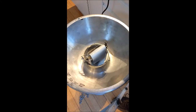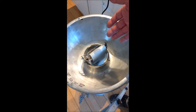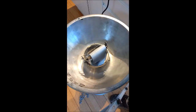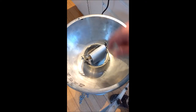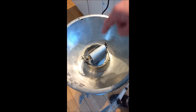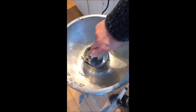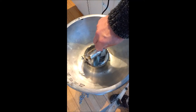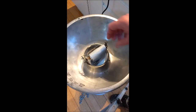Here we have the top end of the machine. You can see the belt, the pulley arrangement, the combs. The comb is just a piece of wire soldered with nails pushed through it — it is that crude. Some of them are knife edges, some of them are just little spikes. It should be arranged so that it's on the downward side, so as the belt is leaving the pulley, you're picking up. This one will charge without actually a comb at all. Under the right conditions, you'll see a spark jump from the pulley down to there. The bottom pulley is just perspex running on phosphor bronze bushes. I've lined the top end with aluminium foil because I find you get a much better charge rate with the different combinations of materials, which is in keeping with the triboelectric theory, I think. That is the top end.